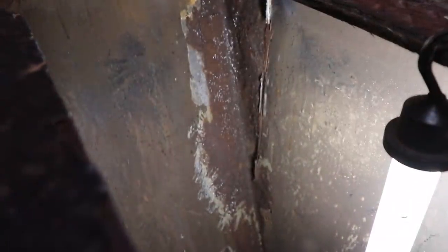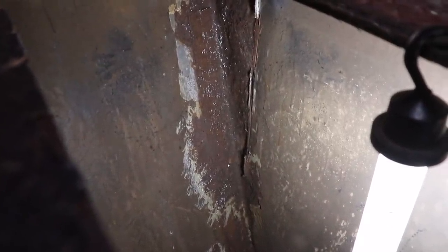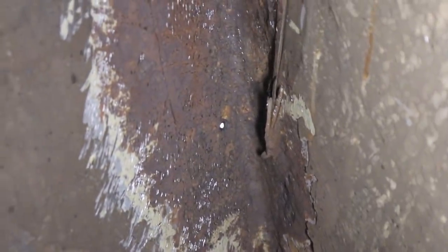What we're doing right now though is Trev's outside the boat and he's drilling in where we saw the original pinhole of rust coming out, so we can locate where that actual hole is. There we go. Got that. So that's our pinhole of rust. We've got a pretty good idea now what caused all of the rust. We've got the location of the leak sussed, and now we're starting to formulate our plan as to how we're going to repair this.